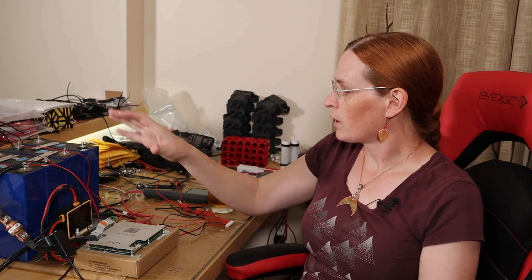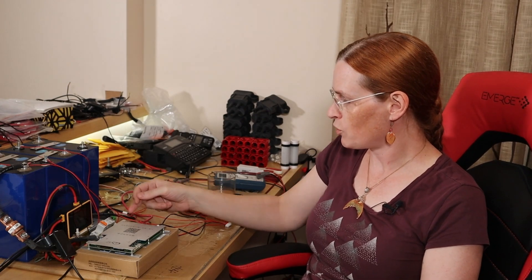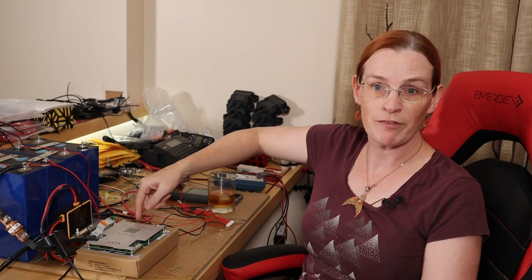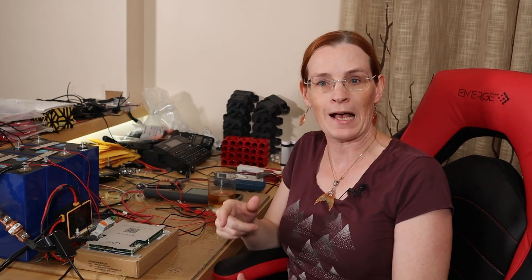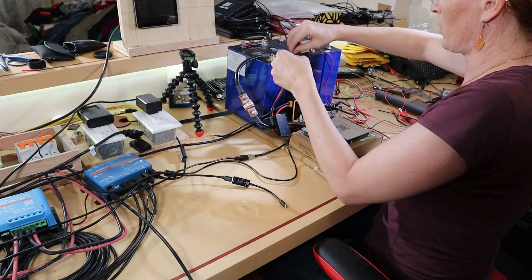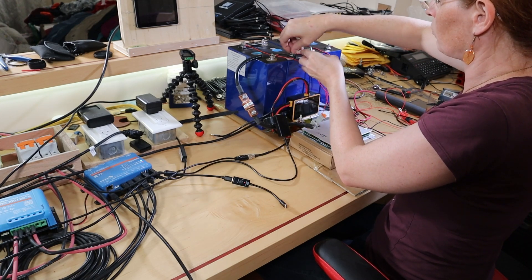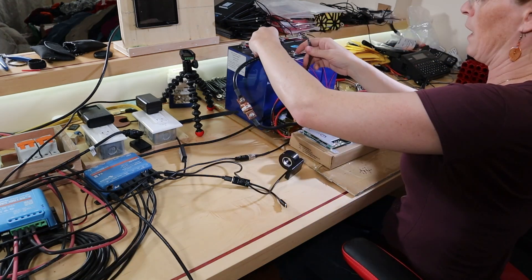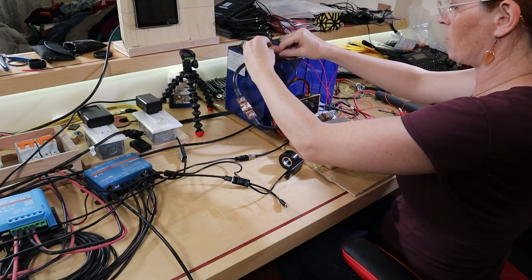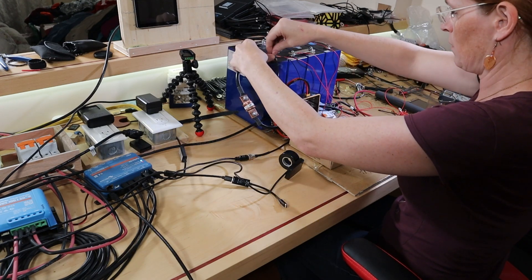The main thing I'm going to do here is reassemble the battery, make sure that I've got the right voltage with the last four batteries disconnected and 25 volts on the last pin, and we'll see if she boots up. As before, I'm not worried about making these cables look nice — this is an incredibly temporary configuration. As last time, I'm going to have a common ground between the iCharger, the battery, and the BMS.